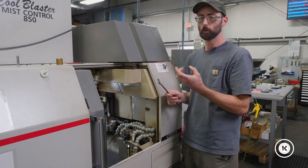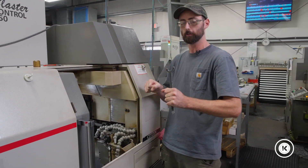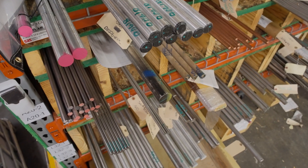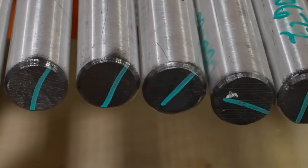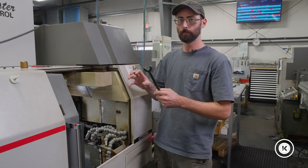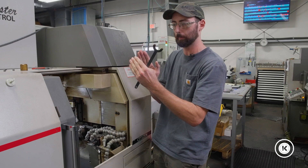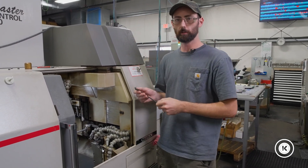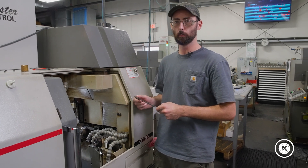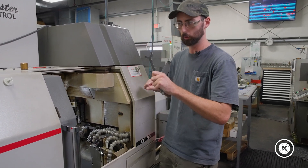Larger diameter bars — you can set it tighter. Your pads are bigger in the guide bushing; you have more surface area to spread out that force. Small diameter material, soft material, non-ferrous materials — plastic especially is very finicky. If you tighten it too much, you will either gall or gouge material out. The pads will gouge material as you're pulling back through. With plastics, if you set it too tight, the material will actually compress while being fed through — compress, compress, compress, then pop through. You'll see grooves or ridges in the OD or ID of your turned part. You'll usually hear it creaking or popping through the guide bushing. If you're running plastic and it's too tight, just loosen it off a little bit.